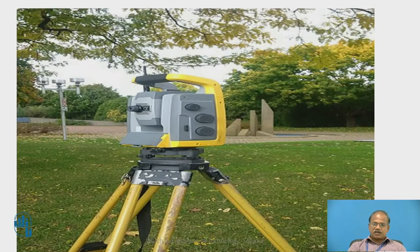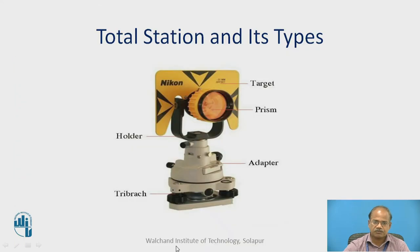You can see a presentation of a tripod on top of which the total station is fixed. From the bottom of this tripod a plumb bob may be suspended, and one can visualize whether the plumb bob is standing exactly above the peg or pin on the ground. In some cases there will be a laser beam ejecting from the bottom, pointing exactly to the point vertically below the instrument, and the pin should be exactly at that location.